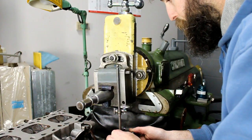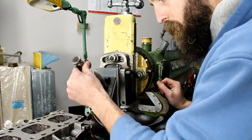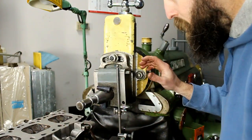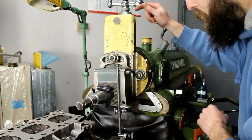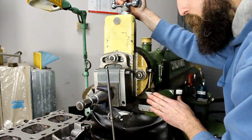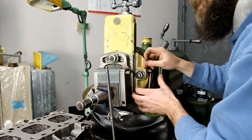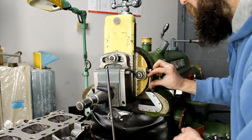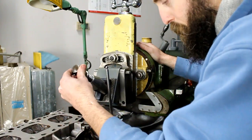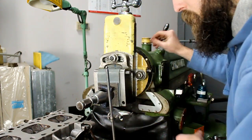What I did last week is I stopped the machine, changed camera angles, raised the clapper, inspected the cutter, and dropped it. What caused that line is: where the gibs are tight and I'm working down on one side of the screw, I'm actually pre-loading this. So right now it has pressure pushing downward — the only thing keeping it from moving downward is the friction of the gibs. The sharp snap of that clapper from me inspecting the tool jarred it just enough to where it moved down, and that caused the line in the surface.